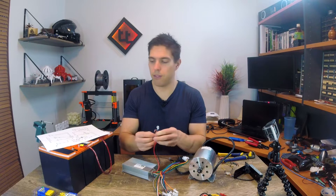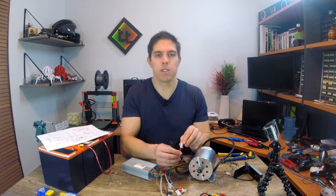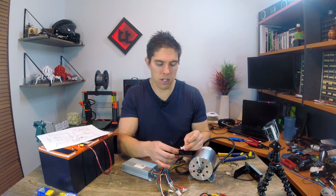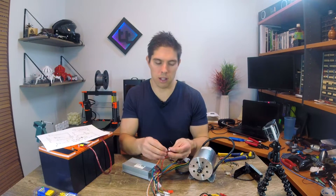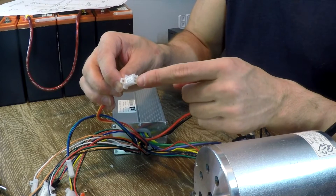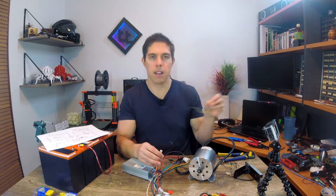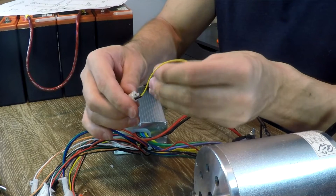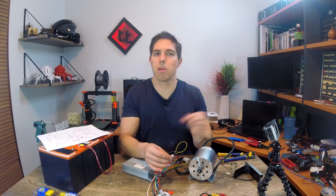There is, of course, the overall positive and negative wires that will go to the battery, but that's the very last thing we do. The first connector we're starting with is labeled power lock — it's got two pins, orange and red, and is simply for the key switch, which will connect to the key already on the mobility scooter. When we short across these two, it turns on the whole system. I have a jumper wire and I'm simply shorting it by plugging into both sides. Later I'll test by pulling one side out to open the circuit and everything should turn off.